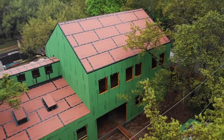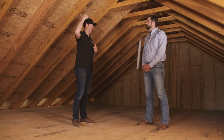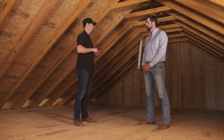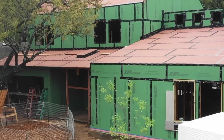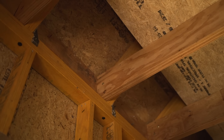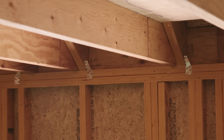When we built this one - I call this 'monopoly framing' - our rafters don't poke through and sit on the wall with a bird's mouth. They're clipped at the end of the wall so that my Huber ZIP decking on the roof transitions right to my wall framing for a very airtight shell. Did that hurt structurally? Not necessarily - we can still have rafter tails or extensions if properly connected. The focus is having a good connection between the rafter and the wall for a continuous load path, using metal connectors rather than just a toenail.